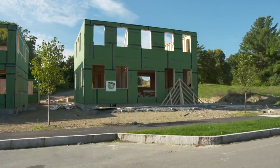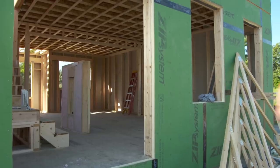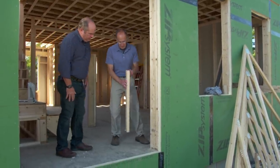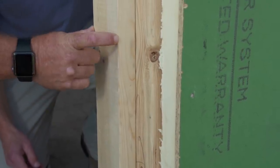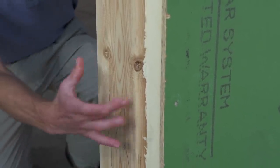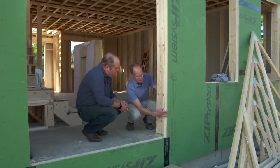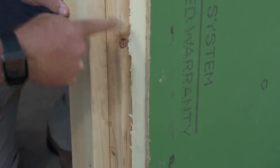So how are you going to do it? Well, it begins by building a really airtight box. In fact, I've got one under construction right next door. This is how all of our houses start out — it starts with insulation. A typical house is constructed with a two-by-four, sixteen inches on center. Our walls, as you can see, are two-by-six — almost double the capacity for insulating the cavity. On top of that, we're putting this insulated panel outside of the frame, so from an insulation standpoint you actually end up with almost double the depth between outside and inside.